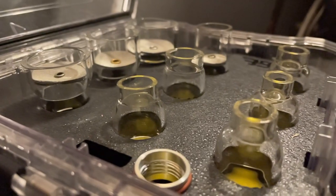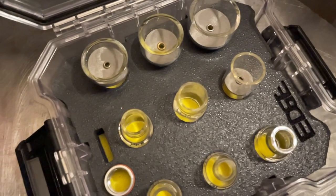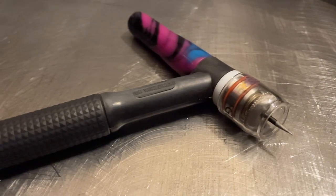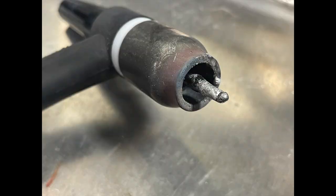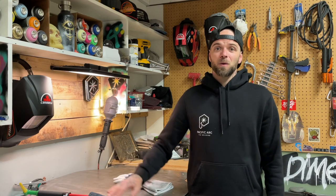I see a lot of people who run glass cups for aluminum. I run glass cups for all my stainless steel welding, but I will never run glass cups when I'm welding aluminum. It's just a personal preference, but here's why — these cups are really expensive. Dipping with aluminum compared to dipping with stainless is much more catastrophic very quickly. A lot of splatter and other material will spray inside the cup and probably end up wrecking the glass.